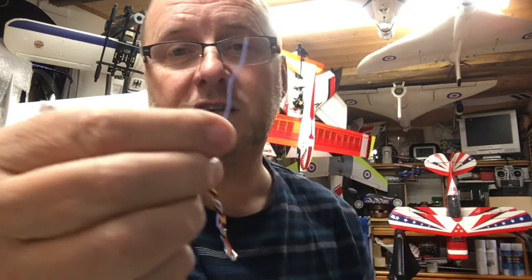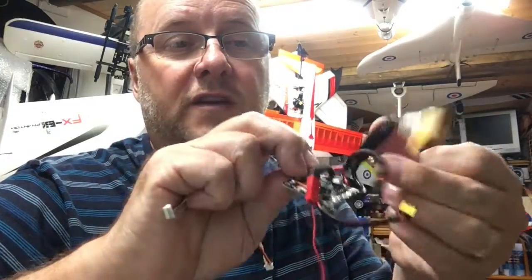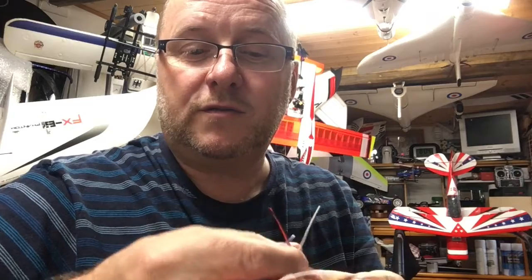You can use this, but a heat caution: you've got to make sure that this is connected — the blue wire will go to the red wire from your XT60, or any of the soldering that's positive to the ESCs, but it's a positive connection from your battery. That will give you a battery voltage on your display when you look at the overlay display. Don't get confused — the white wire is audio. Don't get confused because I've been saying to do this and I happen to be using a lead with a white wire. Don't start connecting white wires to white wires because you're not connecting audio, you're connecting video. Just stick with the video. So check your wires, make up your lead, but do that after the quadcopter is built and working.